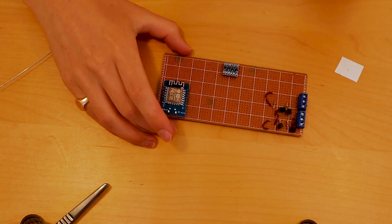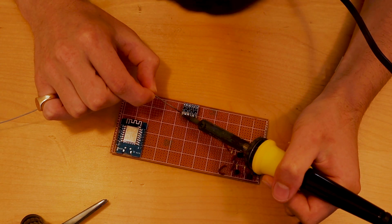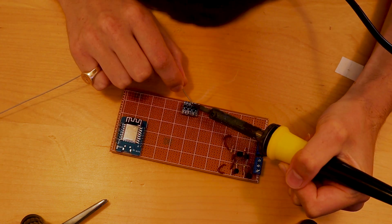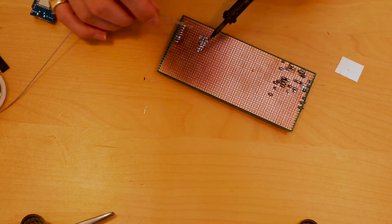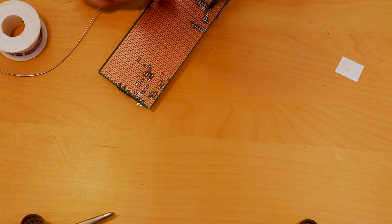As for power injection, this depends on how long your run is going to be and how thick the cable is you're going to be using. I'm going to inject every two meters because I'm using quite thin cable. Because of the way I cut my LED strip, I can use the pre-made injection wires every two meters that are directly attached to the LED strip. Once we're happy with all our connectors, we can move on to making a circuit board for our controller. I'm going to make my circuit on a bit of strip board, but you can make yours on a breadboard or even just using jumper wires if you prefer.